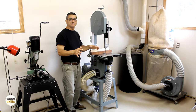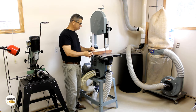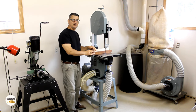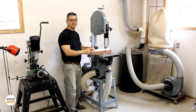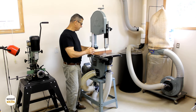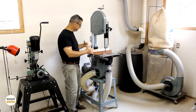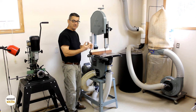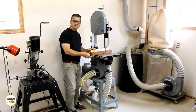The lower part of the workshop is just as large as the upper part. I disassembled the saw and brought it down to parts and reassembled it, which was a good exercise since I had not done that in a number of years. I first set it up without the riser block, thinking I could use it for smaller, more detailed work. But then I realized I'd need to purchase shorter 93.5-inch blades as opposed to the 105-inch blades for a Delta 14-inch. To make everything compatible, I reinserted the riser block with much effort, and needed some help to do it. This is now almost exactly what it looked like at the upper level — the same saw I've been using for 30 years. I've also built up the fence — one I almost gave away years ago and thankfully never did.